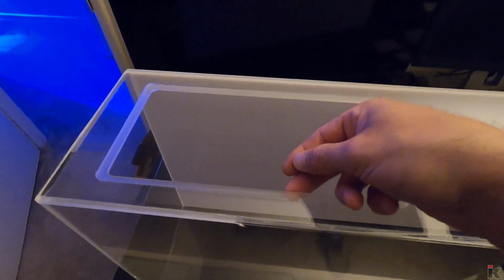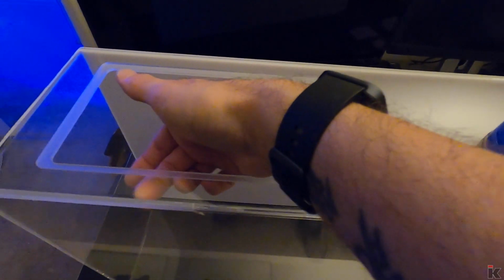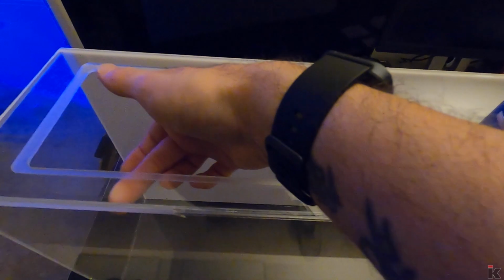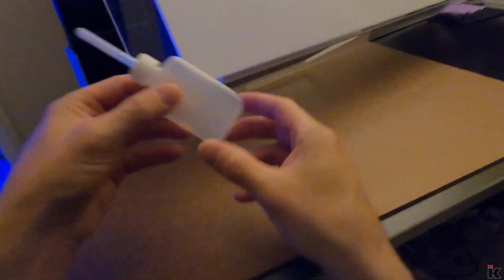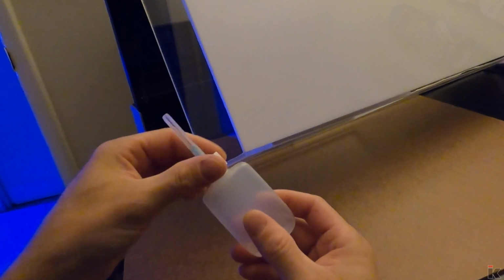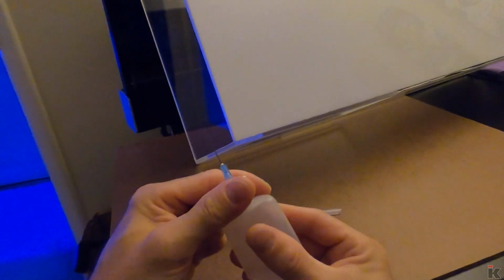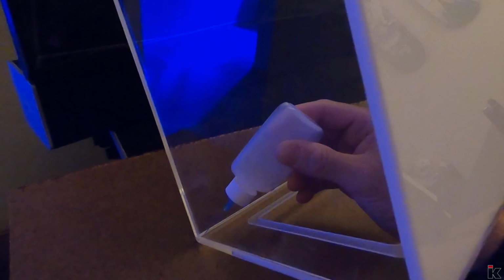And then I can take the applicator on the inside and apply the Weld-On on the inside and fill this crack. So right now I just put a temporary piece of wood underneath the container, and I've got some Weld-On in my applicator container. So now what I'm going to do is just make sure this is tight and this is ready, and then just kind of lean in here best I can and just start applying the Weld-On